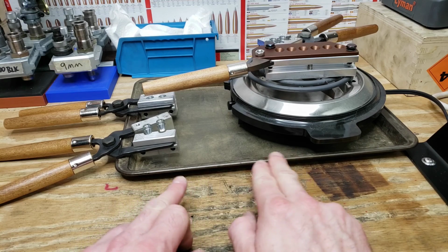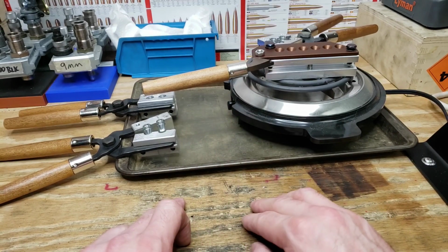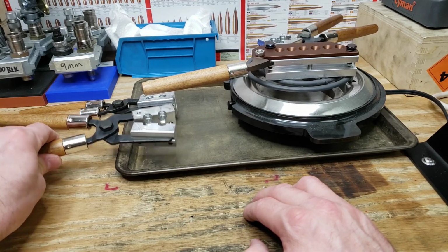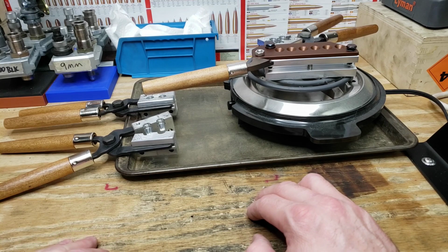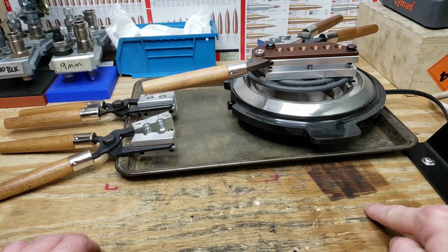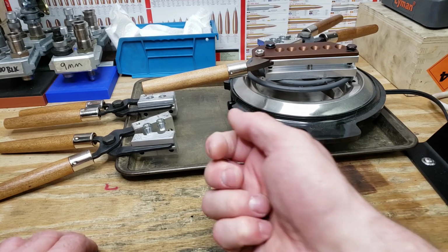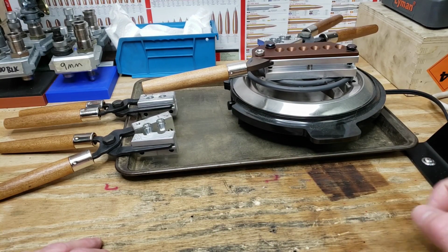And again, I like to use the pan here to protect your bench and also work as a heat sink. When you set your metal handles here on the metal tray, some of that heat will get transferred through that and help cool your mold a little bit quicker. You can see we've also just used the table. If you set that down right there, it'll work, but that's not something you want to do 10,000 times.